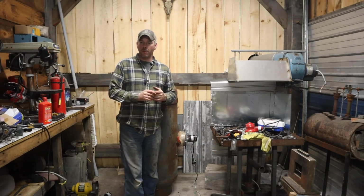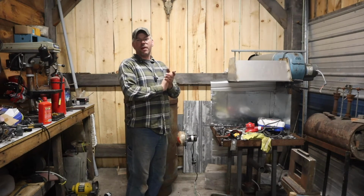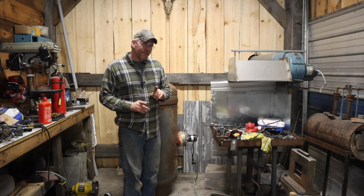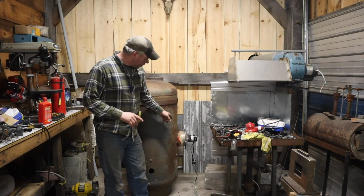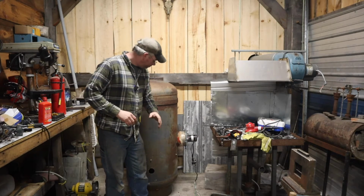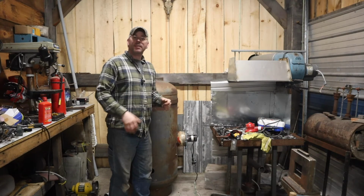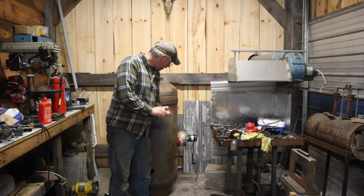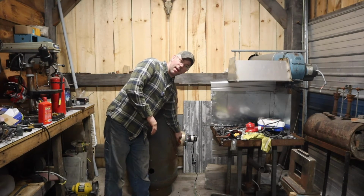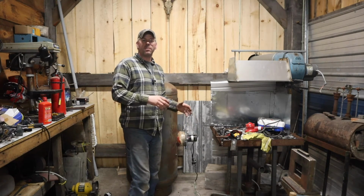So what I need to do now moving forward, I don't like my inducer setup. I want to make it a little bit better, a little bit different. The big thing I don't like is when I cut that off, the zip wheels I use are always stainless steel zip wheels, and it cut just fine. I go to weld on it and realize it's not welding very well. It was actually stainless steel, this portion of it right here, and it's mild steel out here. So we're going to cut that off of there and do that a little bit differently.